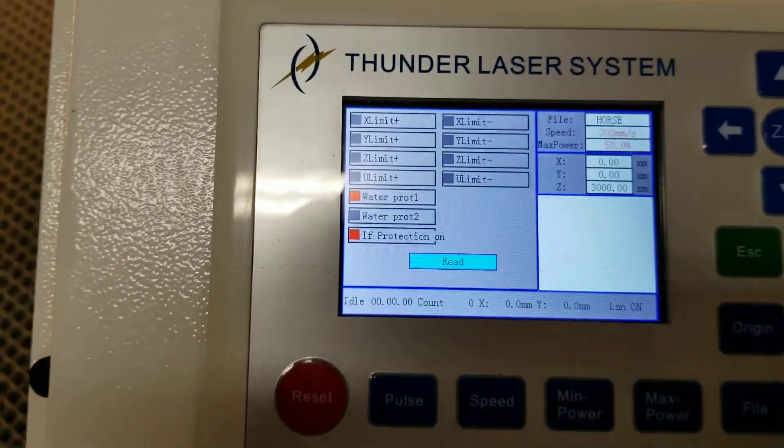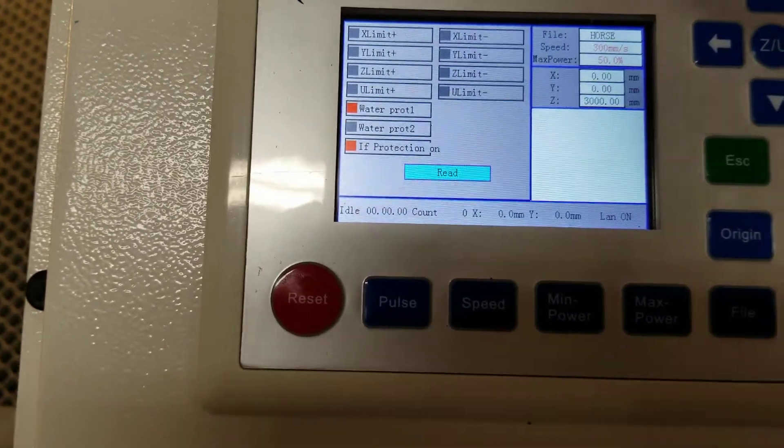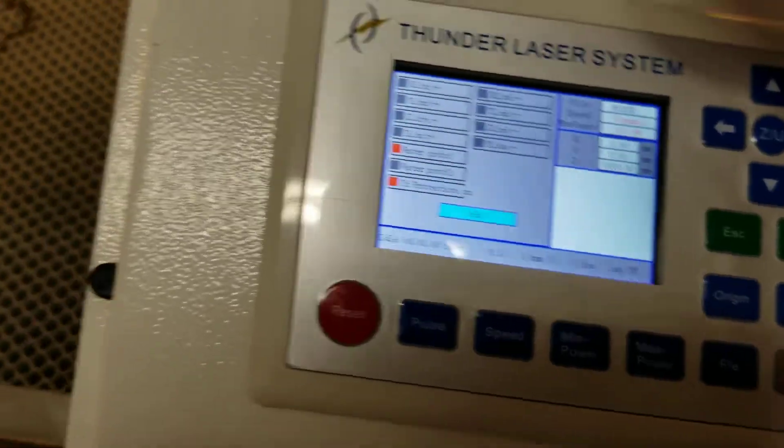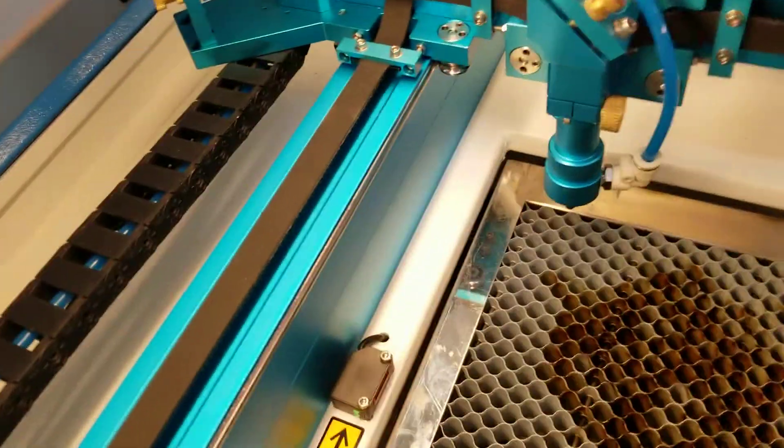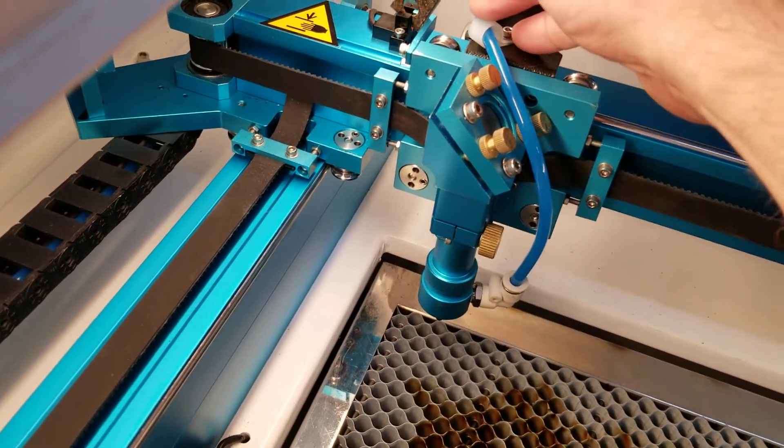As you make and break those sensors, they'll start turning red on the panel. So you can get a buddy and have him monitor the panel, then come over here and make and break these optical sensors to test them and look for the LED here.